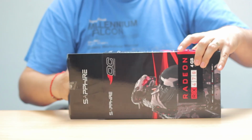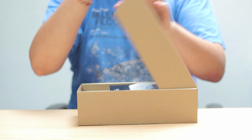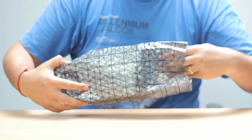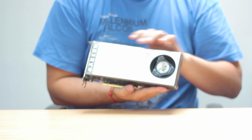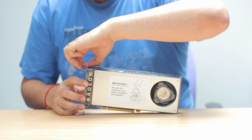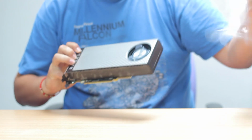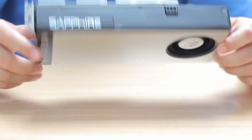This is the follow-up to AMD's RX 480 that we checked out previously, using the same Polaris 10 GPU, but with a slightly cut-down architecture. They've chopped out 4 compute units, which equates to about 256 fewer shaders. In real terms, that doesn't mean there's a lot of architecture being cut out. We're talking about 2,304 shaders for the RX 480 versus 2,048 for the RX 470. It's also chopped out a few texture units, but kept the same ROPS count. So architecturally, they're not that far apart.